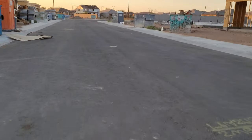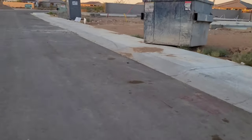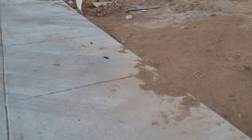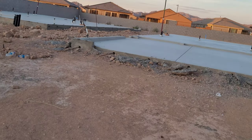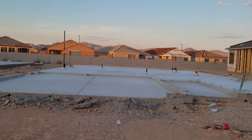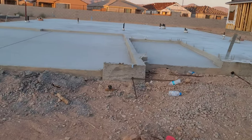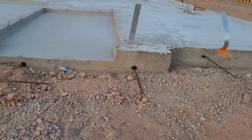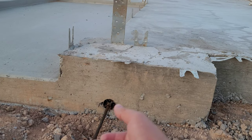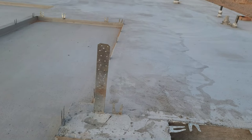These are all the brand new homes going up. This entire street hasn't been built out yet — it's almost there. These guys had the day off, which they obviously deserve working out in this heat. So this is what the foundation looks like after it's been poured. As you can see, these wires are still sticking out, and what they'll do is come by with the machine, attach it to these wires, turn it on, pull them, and you've got yourself a post-tension foundation.